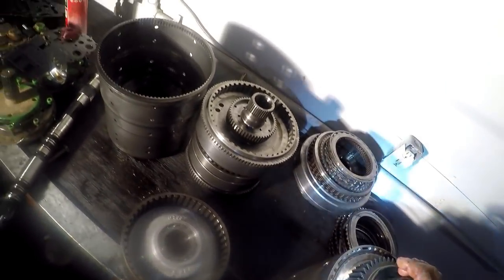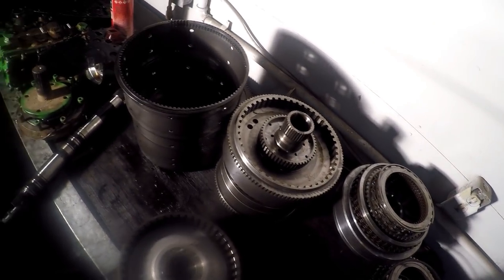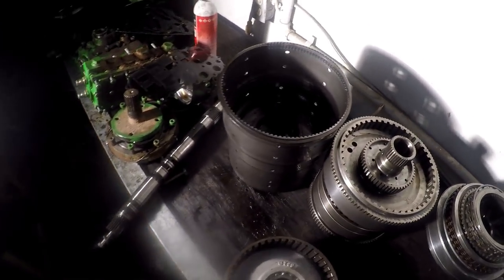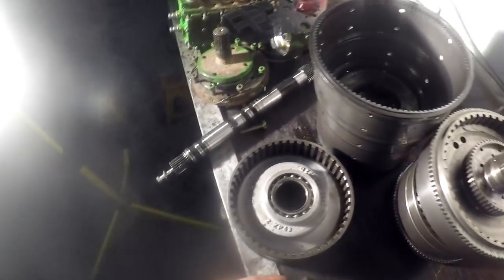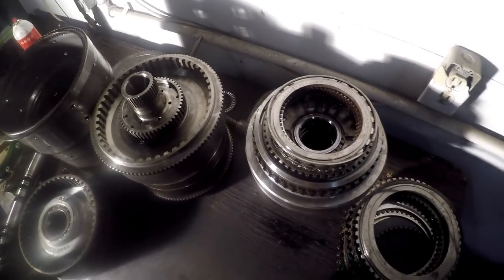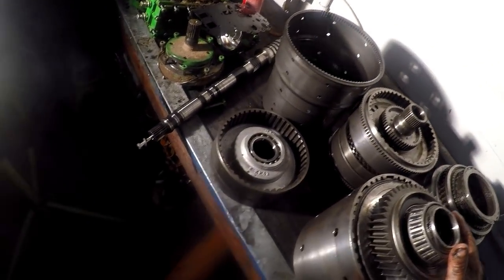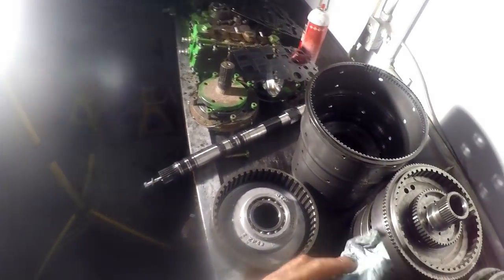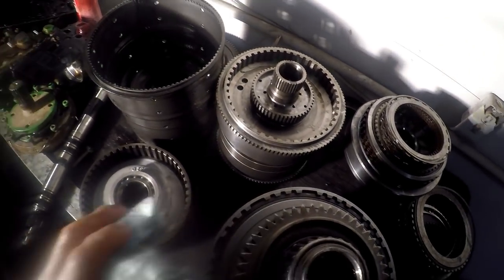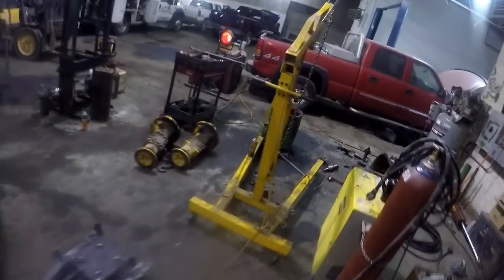I don't really suspect it, I'm just wondering if that bearing on that shaft could cause all the problems that we're having. If it was not wanting to turn the transmission and the computer was kicking it out, it wouldn't let it move because it sensed something between the input and the output side wasn't right. We'll go ahead and take this pack apart too. I think it's going to be identical to the other side, and I don't think we're going to find anything wrong on the packs. I'm just really wondering about that bearing. I'm going to take that hydrostatic control unit up there though and make damn sure and have him look at that and see if he sees anything completely obvious with it. That would explain all the metal in the case, that bearing on that shaft going out.